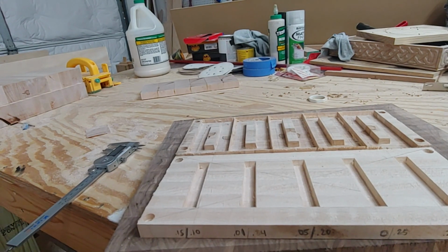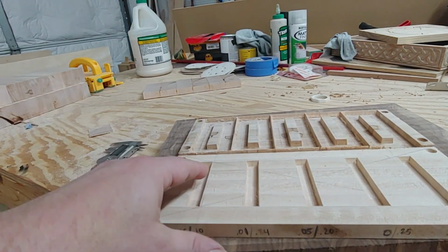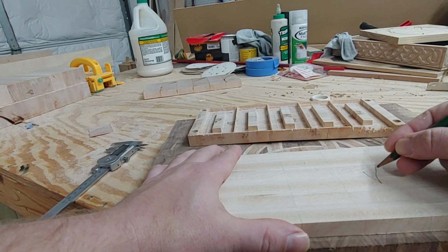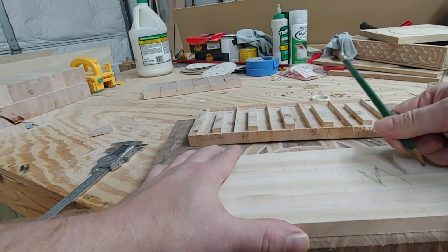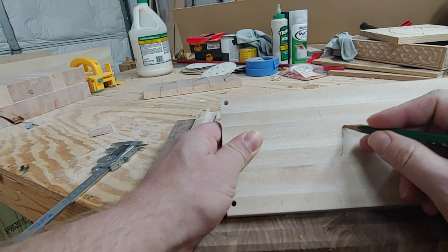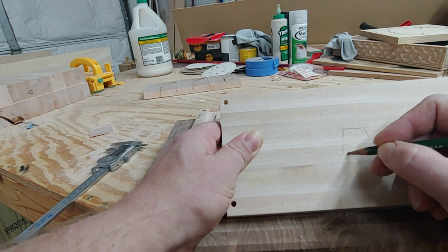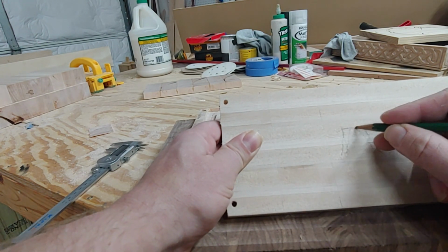And what I am now thinking, now having seen all these results, is that I need to have a deeper start depth. So what's happening is you've got the bit, these two angles, and obviously this is just a rough sketch, but you've got it carving in this way on one side and carving in that way on the other side. So if you change, there's our male piece, right? If you start off with the top cut, then this is going to be the vector it follows. But if you change the start cut down here, it's going to narrow it, because it's going to start here, creating a different angle when it goes on both sides, narrowing this top piece.